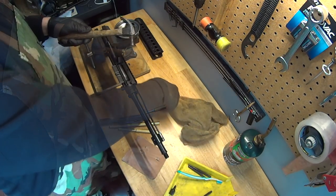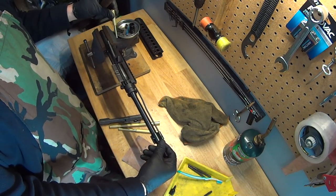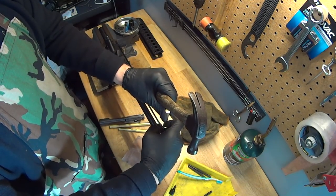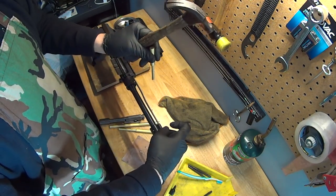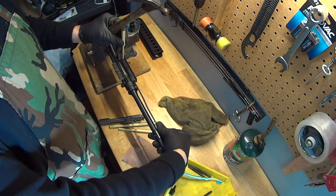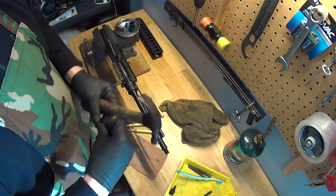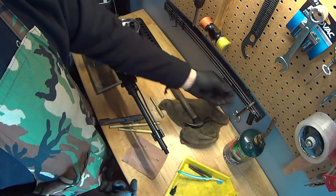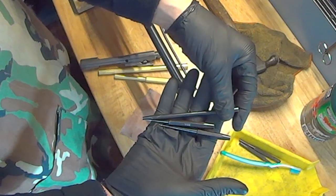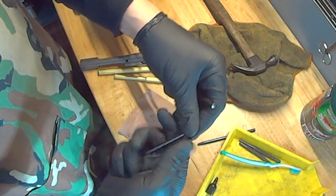Now you stop. Now you take your brass and always make sure that you're seated on the reaction rod, because it will advance off. So make sure you're seated on the reaction rod. Lift again. Place the brass. And it's pretty flush. The Geissele pin set, or the gas block pin starting set, are these three pieces here. Slave punch, and then starter, and then finisher.